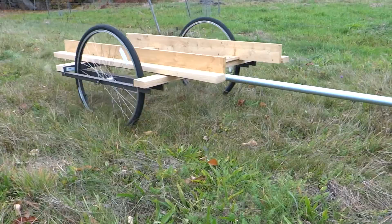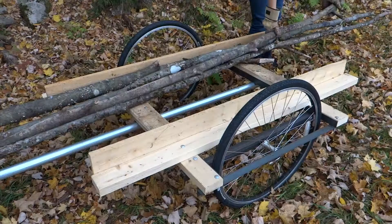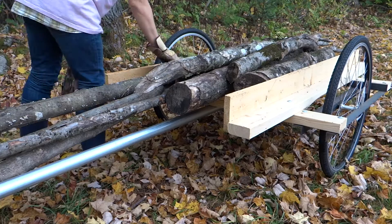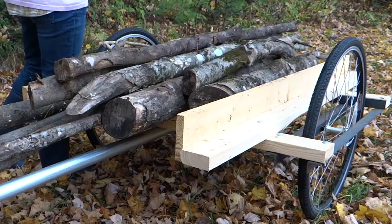This is a simple wood cart for hauling long firewood. It's made from two large front bicycle wheels, some angle iron, some 2x4s bolted with carriage bolts, and it's all connected to the tractor by a one and a half inch diameter EMT conduit that's 10 feet long. All holes in the angle iron were drilled with a metal bit, so there was no welding required.